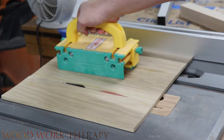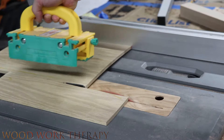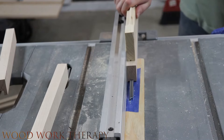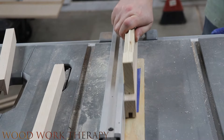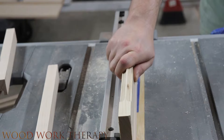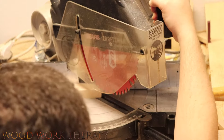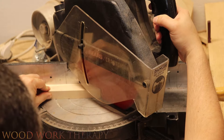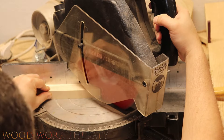Now we're just going to cut down what literally is the lid — the place where the laptop's going to be sitting. This time I decided to use a dado blade for this. You could still use the single blade method, which works just fine — I just happened to have a dado blade and this was more efficient. And these are actually the parts for the bottom portion. Basically what you're doing is just cutting some 45s on four identical pieces, so you're pretty much just making a picture frame at this point for a laptop.